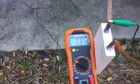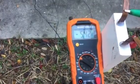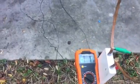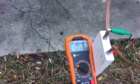I'll grab this green wire and do some ground related stuff. Let's clip on there and go ahead and touch the ground rod. You're starting to see some volts pop up. That's because this is still going through this stuff here — let me disconnect that. Now we're just on the ring and on one side of that primary. I'm going to go ahead and come over here and touch ground, just clip it on the ground there. Ground is popping up voltage anywhere I touch ground — something else is cool.